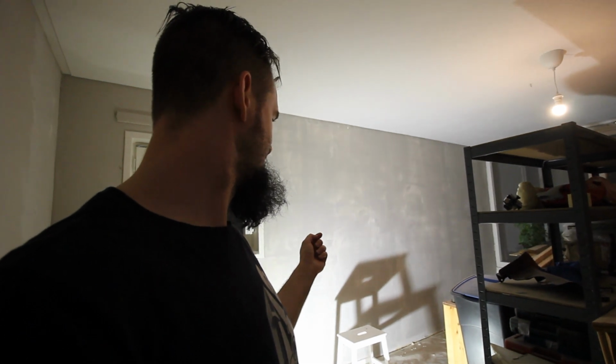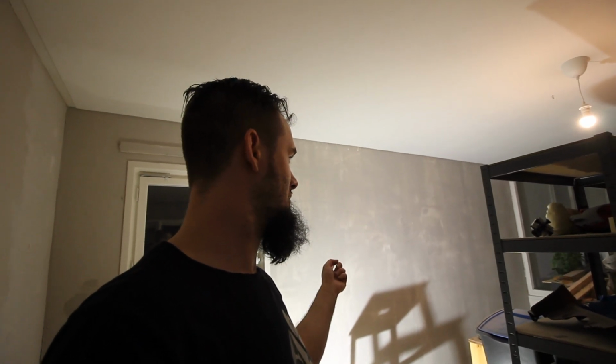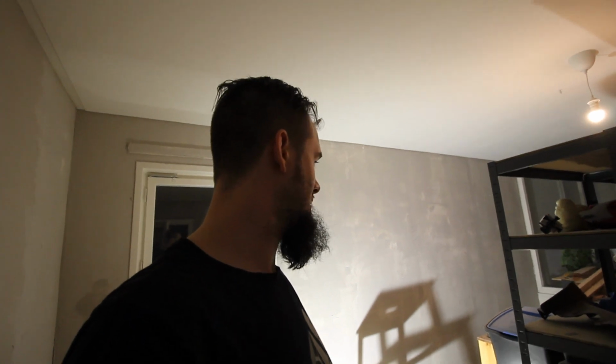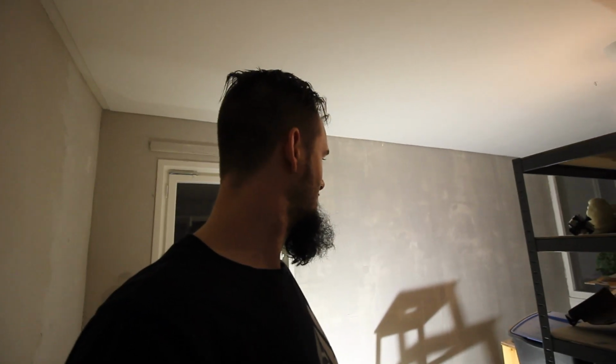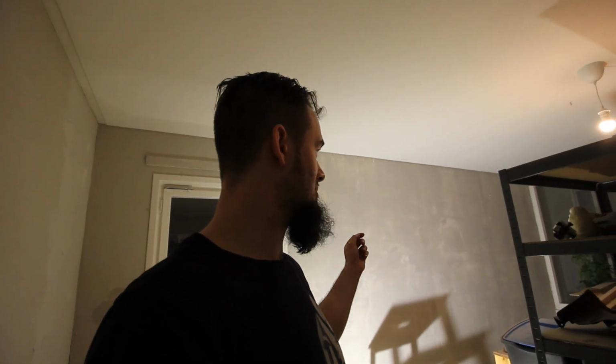That one will go through the same things that the TV wall did, only that this is drywall underneath somewhere, and I won't be taking it down all the way, but there are a lot fewer bubbles in this than last time, so I think I can do spot repairs in this. There are basically no bubbles on the TV wall, which is great. So hopefully I can just sand it and do some touch-ups where it's needed.